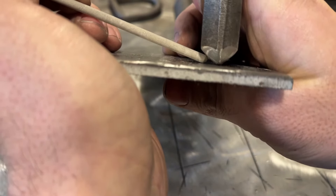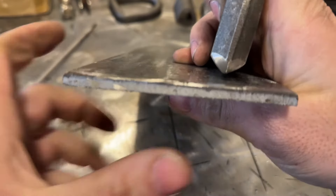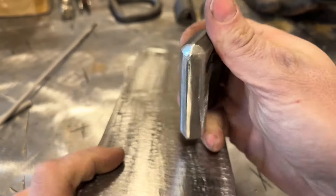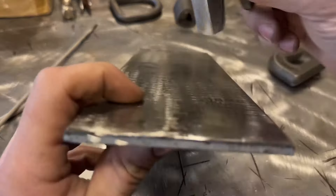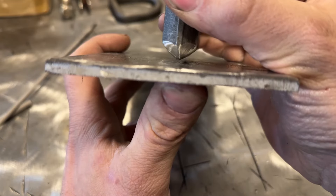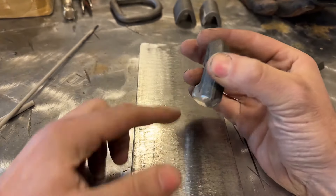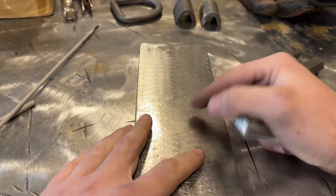With a bit better bevel, I'm getting at least halfway in - that should be in the ballpark of what I want. Now if strength is a real concern, say you're welding this to three-quarter inch steel, you want to leave a slight gap, tack it with that gap, and then weld it. The reason is it gives you more access to weld further in.